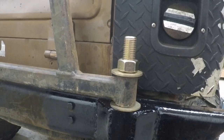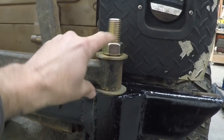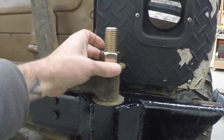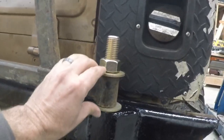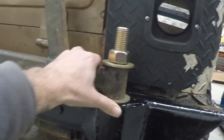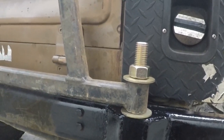The only thing left to do is either get a nylon nut for this or drill a hole through this and put a cotter pin through it to keep this nut from backing off. This nut doesn't even really have to be tight — it's just got to be on there enough to keep the play off, like this washer. It doesn't need to be super tight, just tight enough to keep the slack off from bouncing around too much. I think these washers help because that bushing — I don't know if it's bronze or brass or whatever it's made out of — it's a little wallowed out in there, so it's got a little bit of play. But with these washers on the top and bottom, it takes a lot of that play out, so it makes it a pretty snug fit now.